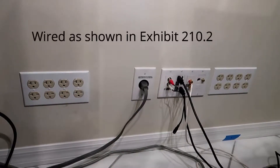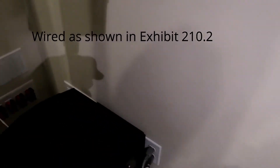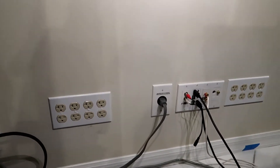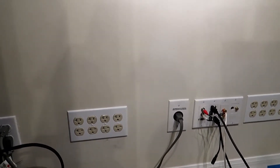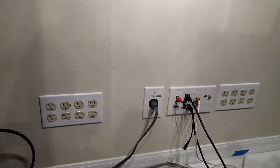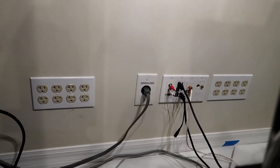I've got 220 and I have 115. These are where the receptacles are added. The wiring runs through metal studs, through the wall, and around the corner. That blank plate was just a hole I cut so I had access to get the wiring around that corner. I wanted eight circuits, but I had to reduce to six because of voltage drop — I couldn't use 12-gauge wire, I had to use 10. So I've got six 10-3s running through these outlets.